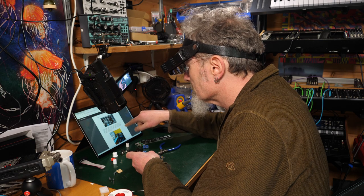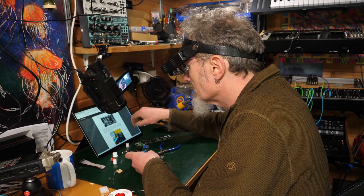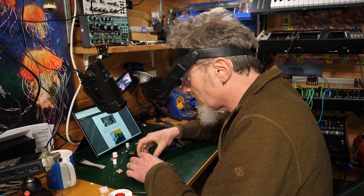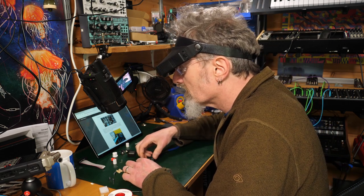So that's cool. So yeah, the notch is facing out from the PCB. Turn it over and solder in place. Use some flux on the pins. Really? This will aid solder. Good idea to get some flux on parts like this where it takes longer to heat from the soldering iron to transfer. Okay. That's interesting. That's not something that I generally do.